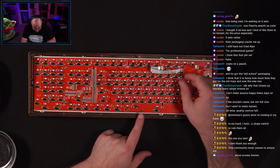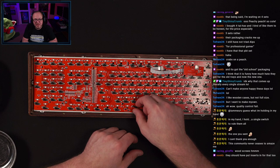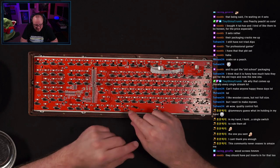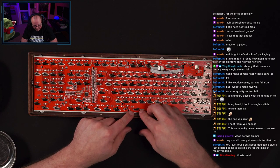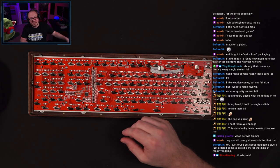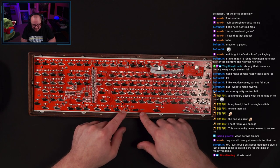So this trace obviously came free. The trace between that diode and here is still actually hanging on by the little microfilament. The portion of the copper layer of the PCB peeled up, and it's hanging on there, right? So we're gonna have to figure out how to glue this sucker down. Just so you guys know, there's a couple different ways you can handle this. One would be to sand down the little pad a little bit and try and glue it down with super glue. Super glue is a little brittle, so eventually it'll pop off. So what we're gonna do is make sure that the wires that should be attached here are, because it delaminated this other pad too.